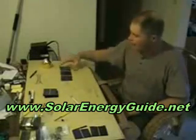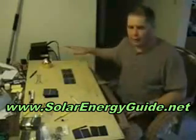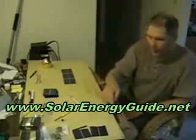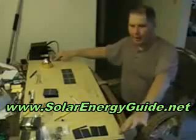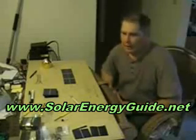It's always going to be positive side to negative side to positive side to negative side, so that they're all in series. Because if you went top to top, that's positive to positive — that's not what you want. So it's always top to bottom, top to bottom. You're going to go all the way up, come over, come all the way back down, come over, and come all the way up. Then you're going to have a negative and a positive at opposite ends. And if you wire your cells together, they'll be wired together in series or parallel.